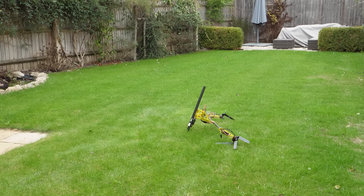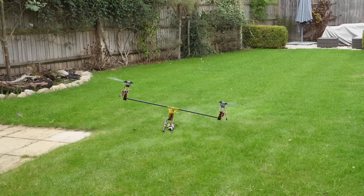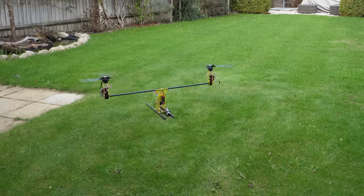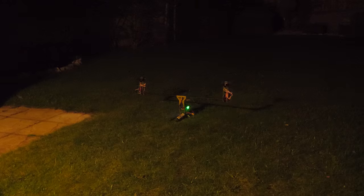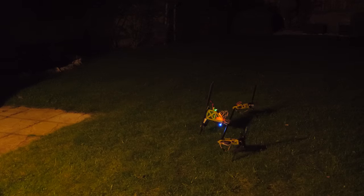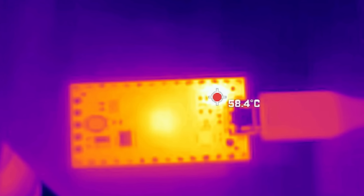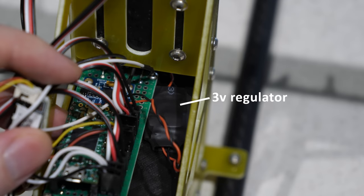And now we've taken a few steps back. Basically, what's happening is the flight controller is shutting down, causing everything to restart. But it's occurring randomly, so I can't figure out exactly what the cause is. It turned out to be the 3V regulator on the flight controller board, which was evident using the thermal camera. So to fix it, I added an external voltage regulator and the issue was solved.